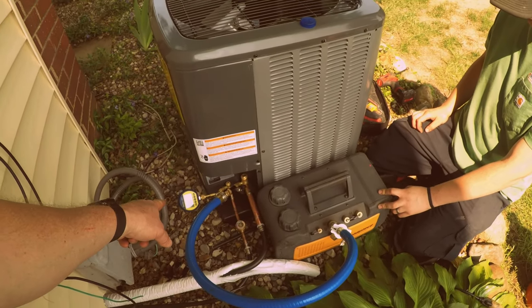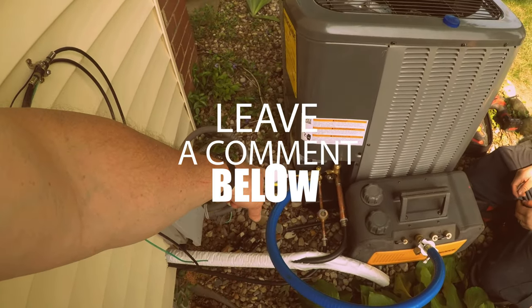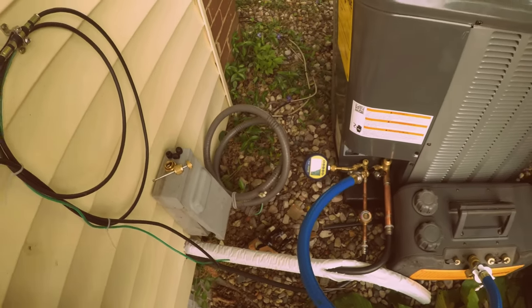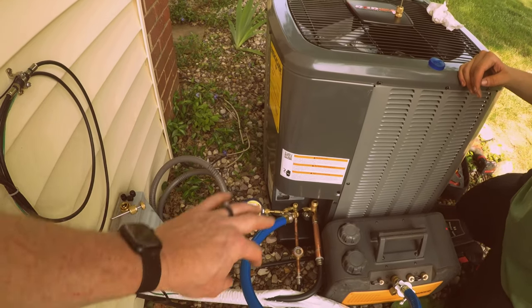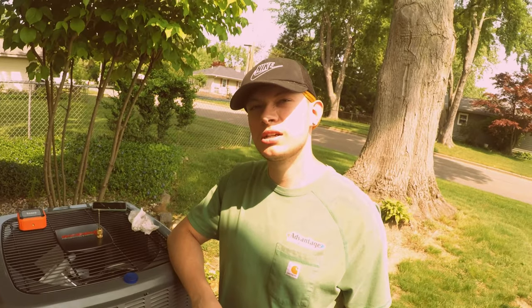So once this reaches about 1,000, then we'll open that back up. So you keep an eye on these, see these here? See them dropping? Yeah. So right now, do you know what we're taking out? The nitrogen. No. Condensables, moisture. Okay.